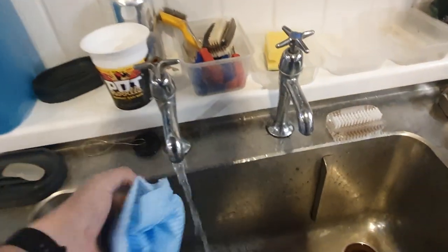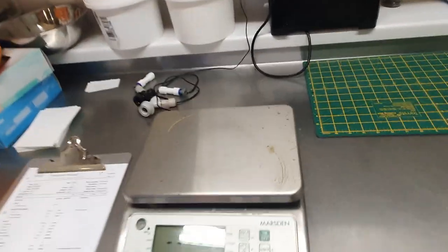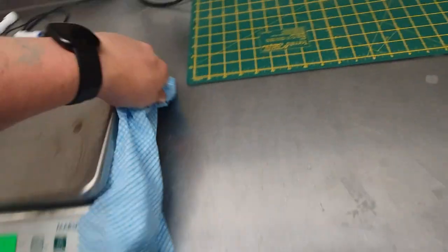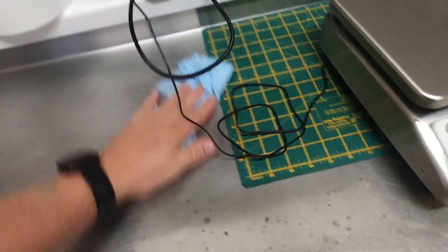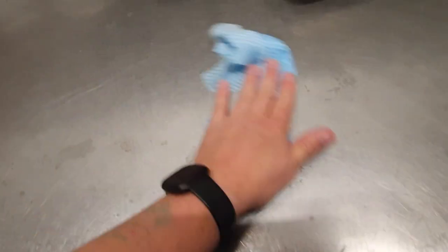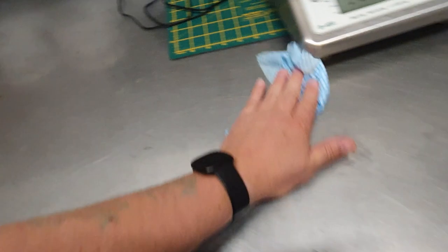One thing I always do is clean down the surfaces after I've used the AMS, because it is actually destructive to stainless steel. You see all this staining on the stainless? That is from splashes of ANS or AMS, depending on which brand you buy. You can see all these little pop marks on the stainless — that's all from AMS splashing. It corrodes stainless steel. It's got sulphuric acid in it, so maybe that's the key.